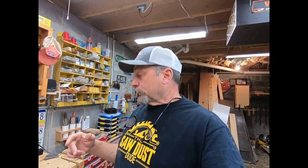And so I'll lay down a couple coats, but before you do that, you wipe it down with a tack cloth or a damp towel, making sure you don't throw down lint on there. It's a good towel to do finish work with, or even a strong paper towel works well. And so I'll throw down 2 coats of clear coat, and then go over it with about a 1500 sandpaper. A lot of people use steel wool, but with all the little fibers and everything, I just use sandpaper. Go back over it, and it'll leave a white, hazy kind of look on it, but it gets the orange peel, the bumpiness out of your finish. So you just go down with that 1500 and lightly sand it and knock off the high spots.